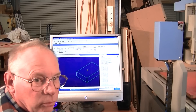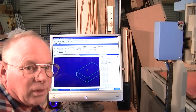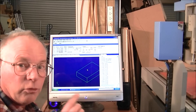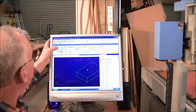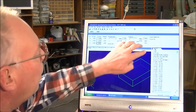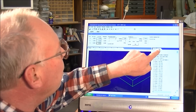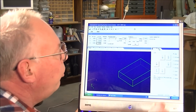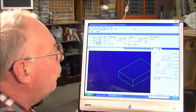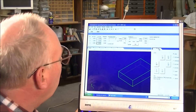So now we're going to zero the machine with NC Studio — it's pretty well exactly the same process. Just jog it over to wherever you're starting your program, your work offset, and you just click these boxes which sets the zero up. In this window you have the G-code, and you can switch between it by going to the next tab, which takes you to the jog window. There's also a prompt that tells you how to obtain rapid jog — NC Studio does prompt you quite a bit like that.